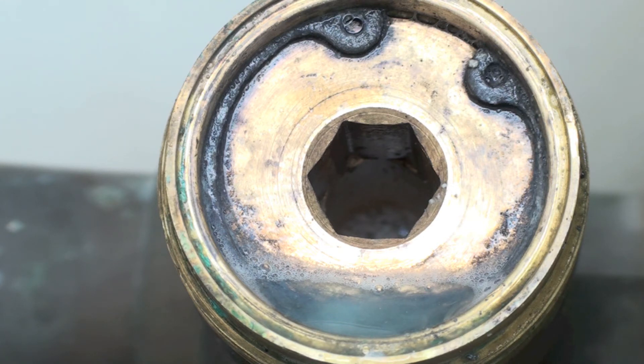One of the things I usually tell people about service valves: first, look for oil, then check the mechanical fittings — that is usually the service valves. And if it's not the service valves, go back to the service valves. I know that sounds kind of silly, but it's almost certainly going to be the service valve. I'll be showing how this valve is repaired a little later without replacing the valve.